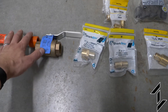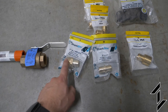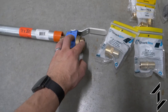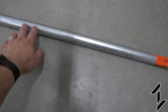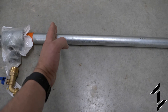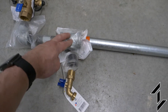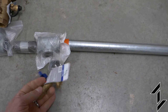Next we want to go to a galvanized pipe with a water shutoff. To do that, a 1-inch MPT threaded fitting will go into our valve shutoff, which will shut off in the fall and drain all the water past this point in the system. This will be under the house in the crawlspace, some distance from the actual edge of the house. We've got a three-foot galvanized pipe — the outside edge of the house will probably be about here, so most of this will be inside where it'll be warm and won't freeze. Then on the outside this will all get drained out. I have a three-way 1-inch galvanized fitting with a reducer to three-quarter and a hose bib here.